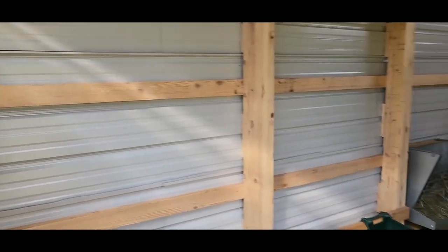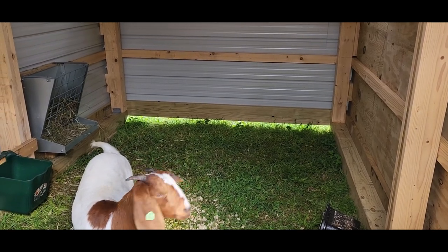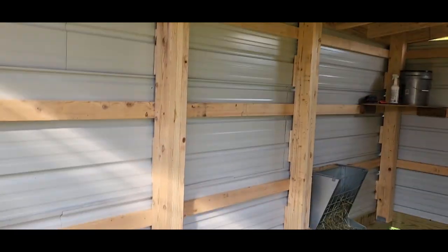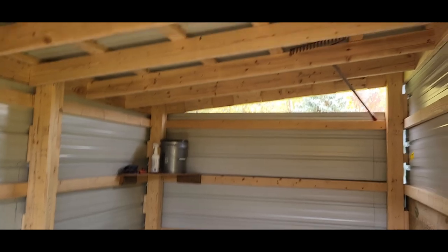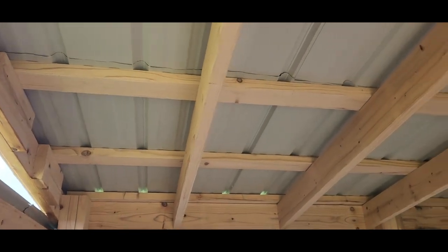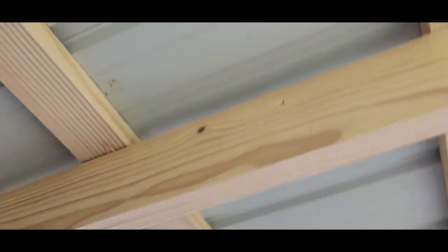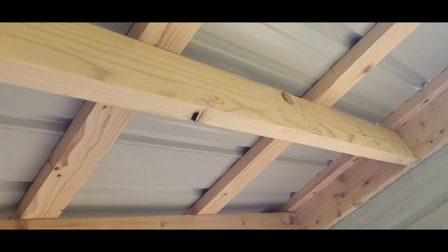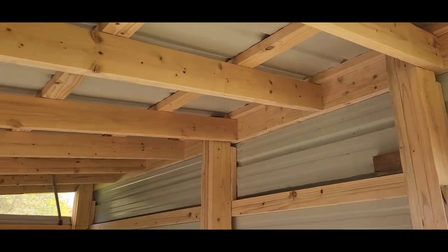Because it's a new design, and I knew that grabbing those sleds on the bottom and yanking this thing around, I wanted it to be quite strong. You can see up here just a typical rafter system, then I put the two by fours over the top of that and secured the galvanized sheeting to the two by fours.